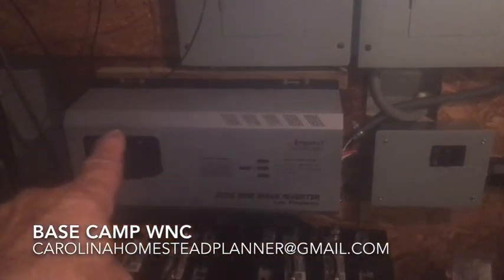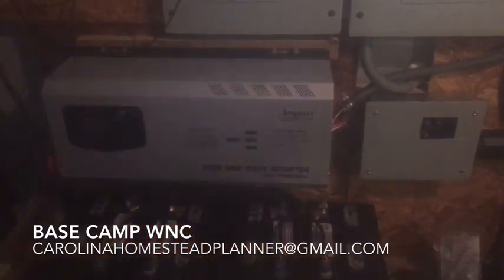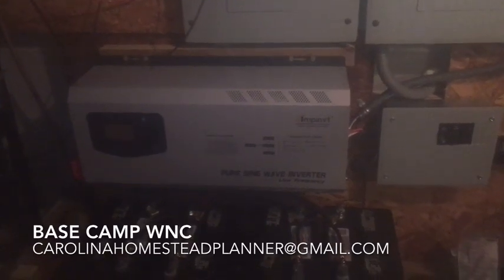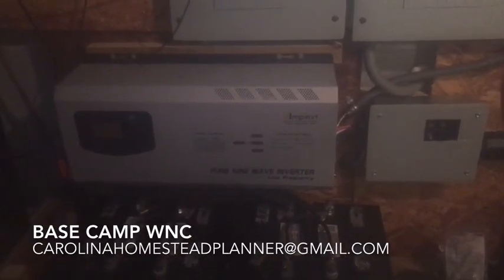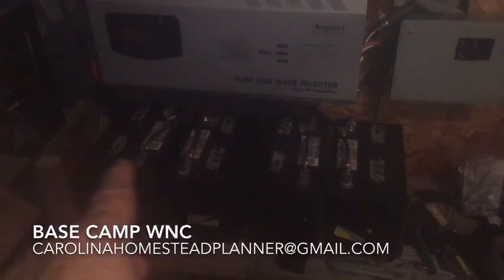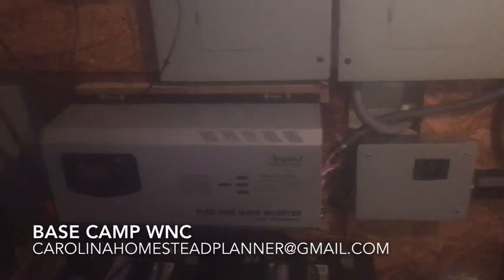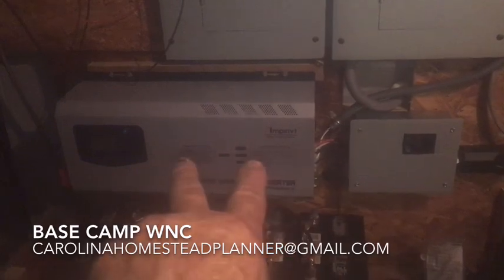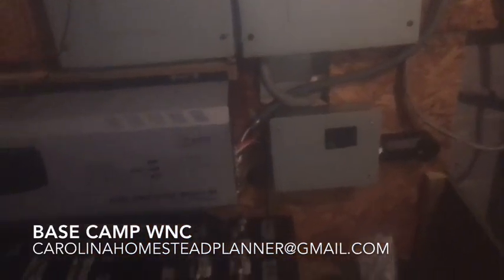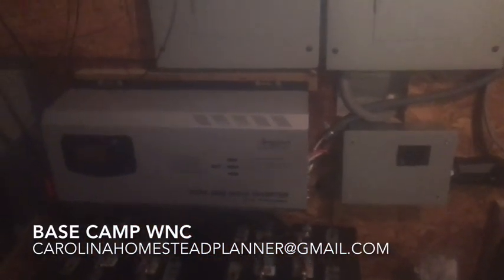This box right here is 6,000 watts. It's got 30 amps coming out both legs, so it's more than enough. This thing has an AC priority on it, a PV priority — so it'll go off the grid as a priority, solar as a priority, or intelligent mode. As soon as the grid goes down, it'll switch over to battery supply right here in the battery box, and when it comes back on it'll switch back up if it stays in PV. If it's been snowing too long and the batteries don't get charged up enough, the box will automatically switch back over to the grid. There's a grid feed wire into this thing.